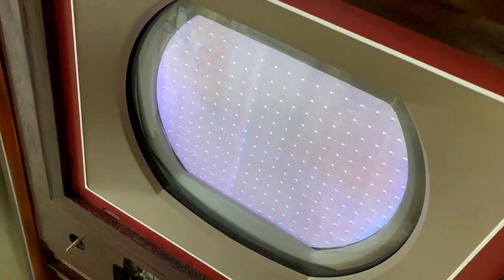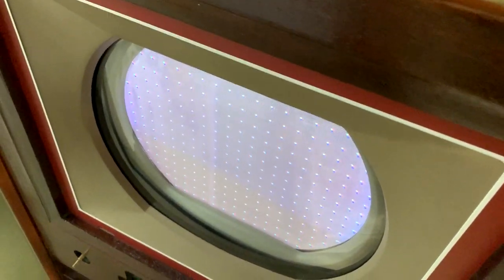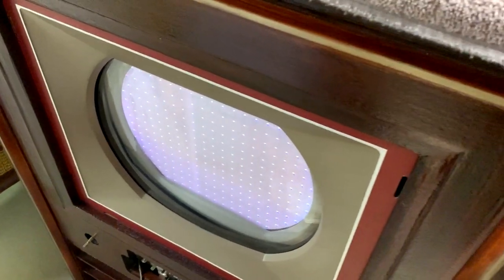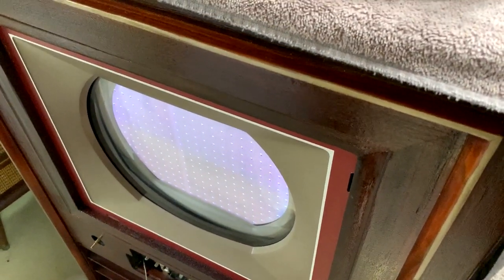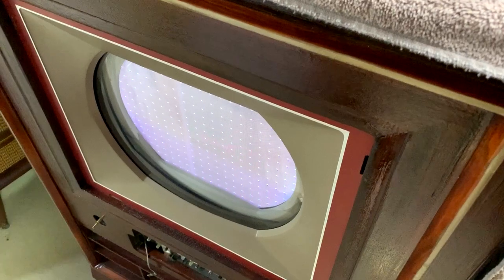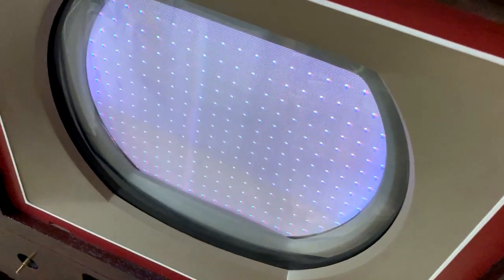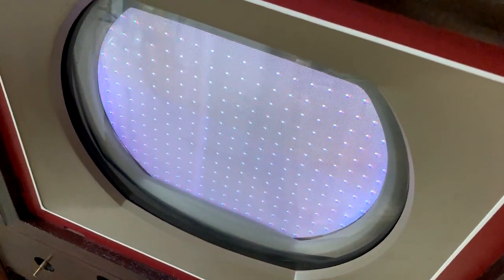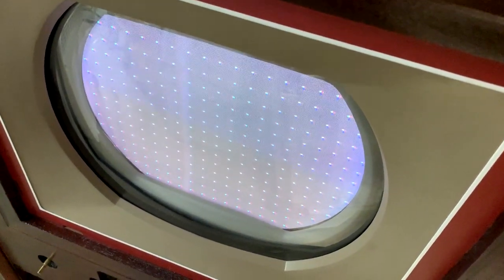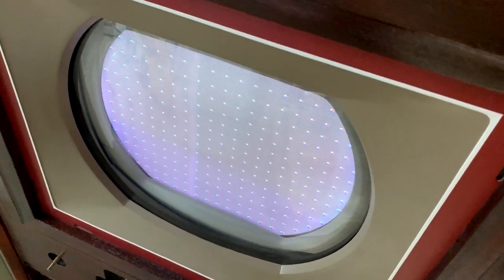The mica material inside the RFAGC tube was actually peeling off and shorting the heater. Moving the leads around caused a short. That line you see in the picture is not from the horizontal drive — that's the tuner and it's a separate issue. My IF is perfect, but my RF tuning slugs on the strips all need adjusted because every channel is different and it's all over the place. Something must have cycled on because the lights blinked — the freezer, air conditioning, and dehumidifier all just turned on, pulling power.